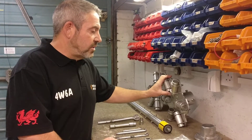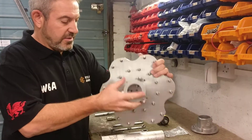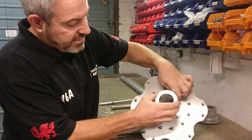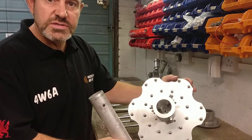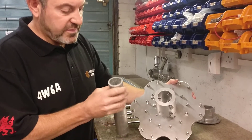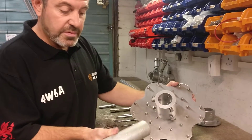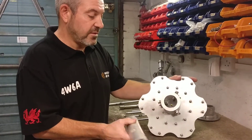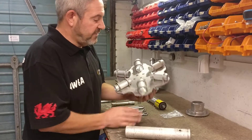Welcome to a brief video on how to assemble a new hub which we changed early this year. The main change is the bottom flange — it will now accept a varying number of tube sizes. I recommend anywhere from two inch to inch and a half, or 50mm to 40mm. Wall thickness should be two and a half to three mil minimum. This is a scaffold tube, which is a favourite here in the UK and Europe, but Japanese and American customers find those sizes difficult to get hold of, so hopefully this will remedy that.